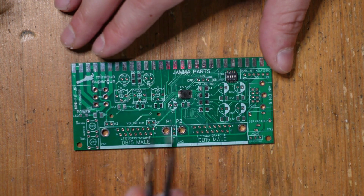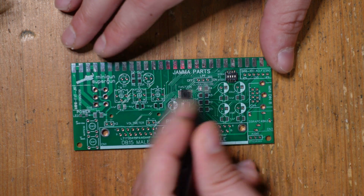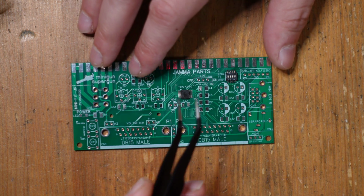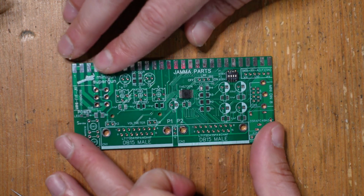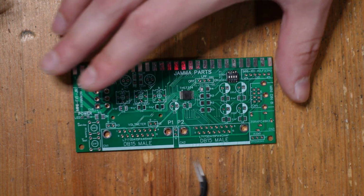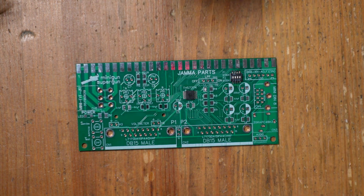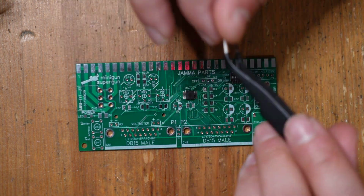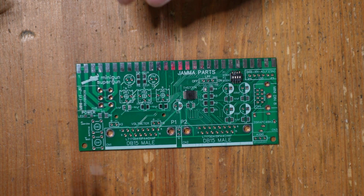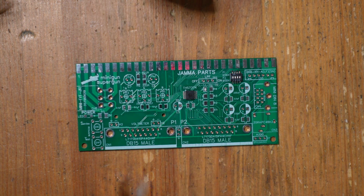So, for example, Neo Geo has 4 buttons, A, B, C, and D, and so A, B, and C are part of the JAMMA standard, but then if you flip these dip switches up, you can get those 4th buttons on the JAMMA harness itself so that this thing is compatible with Neo Geo games. That's just one example. So, it's a little bit convoluted. I don't want to go into all the details of how different arcade boards are wired up in terms of their harness, but this does increase compatibility with certain types of board sets.